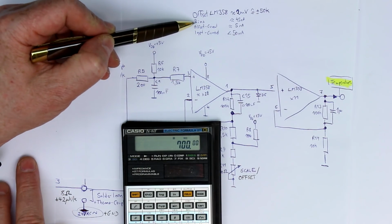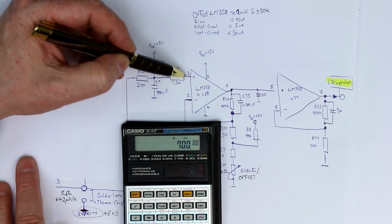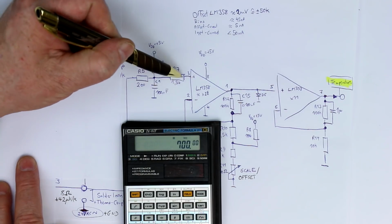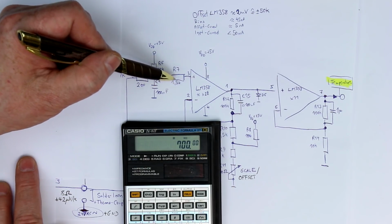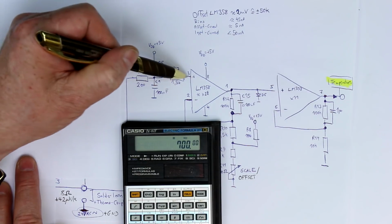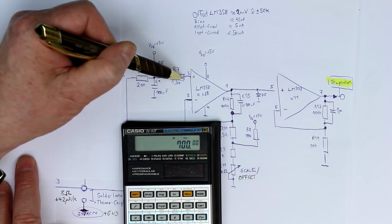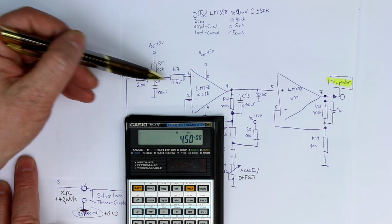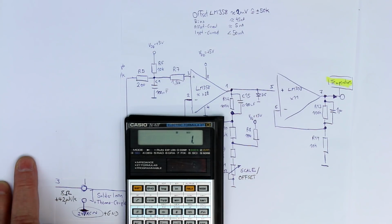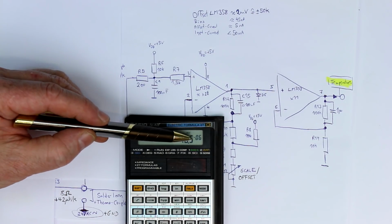And now let's see from the datasheet, we have 45 nanoamps flowing out of the input terminals, or into, it doesn't matter, and they flow through the 1.5K, the 200 ohm resistor and the 8 ohms. So let's add this up to 1.7K, and this of course gives an offset voltage generated by the bias current and the action of Ohm's law when a current flows through resistors. So let's see what 45 nanoamps multiplied by a total resistance of 1.7K gives. And this gives us 76 microvolts.